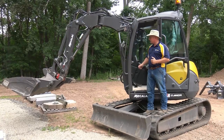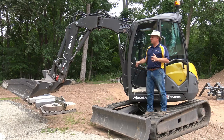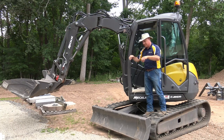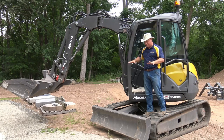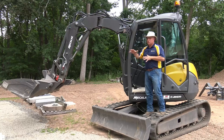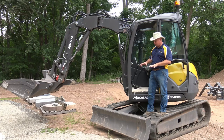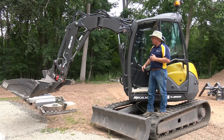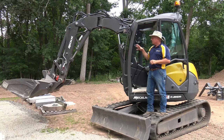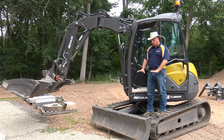All the hydraulics are overbuilt for stability, and it's made to handle a seven-foot bucket on the end of your excavator stick, which makes it very unique. You can do your digging out in front of you, spin your turret around, and load trucks from the back without doing all the skidding motions. When you start doing a lot of movement on your sub base you're pumping up water, so in wet conditions you can sit in one place, dig, spin around, and load out.